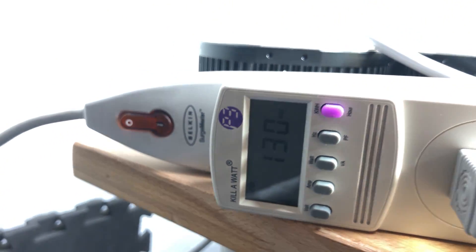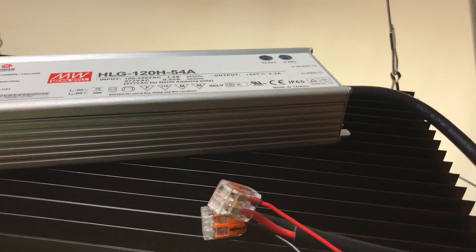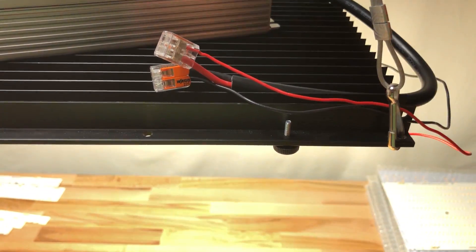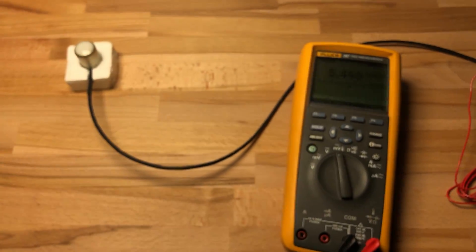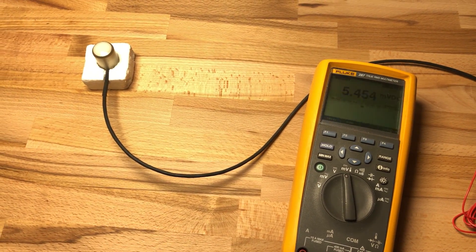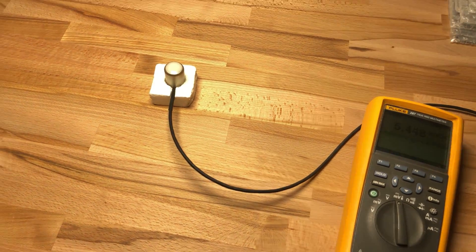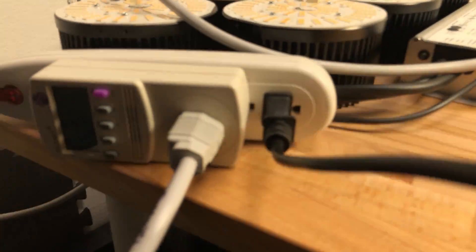I had to turn the current down and tune the driver to make it hit that 130 watt draw. So if you turn this thing wide open, you can eke out considerably more — over 540 micromoles per meter squared per second — at a power draw of about 151 watts. So there's lots left in the driver, and running it hard gains you even more.